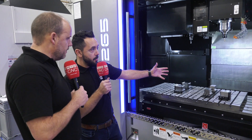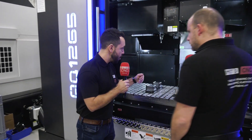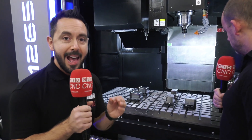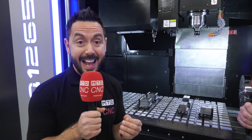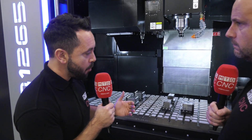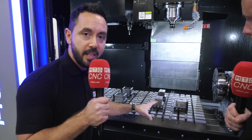This micro lock system has quite a large base plate — often the kit 75 is a lot smaller, but some companies do try to fill the table. With this particular model, the 1265, it's got a 650mm Y-axis stroke and a 1200mm X-axis stroke. That's quite a large envelope for a three-axis machine tool, and this micro lock system is exactly what utilizes that envelope.